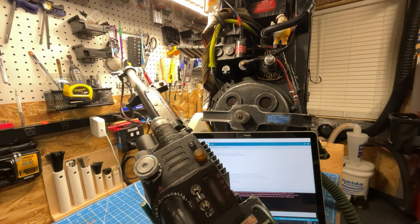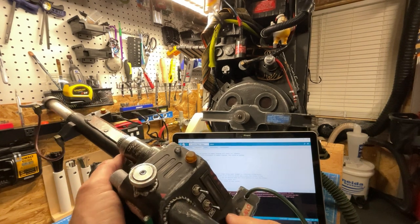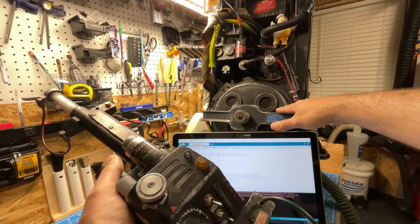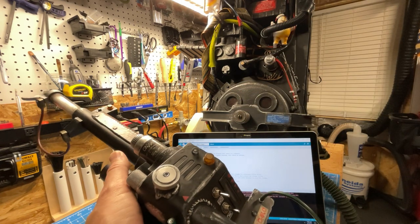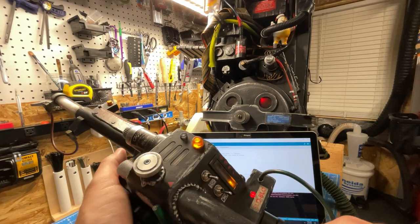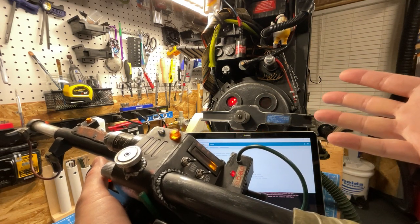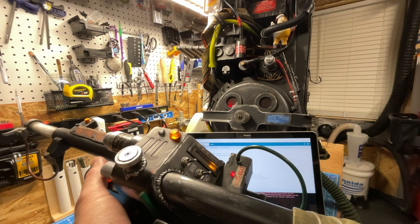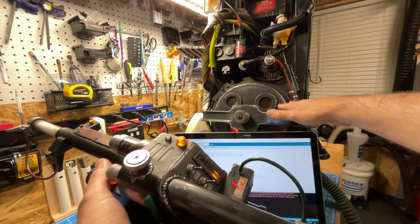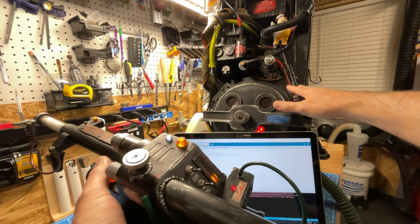All right, and that's it. Now, one thing to know, as long as there is power flowing into any of the USB connections, whether that's the board on the wand, the board on the pack, or you're supplying battery power, USB will supply sufficient voltage from any of those points, because basically all the positive connections are shared, all the negative connections are shared. The only thing you won't get is audio from your pack, and that's because the audio system, what we've recommended, uses a 12-volt system to run the amplifier.